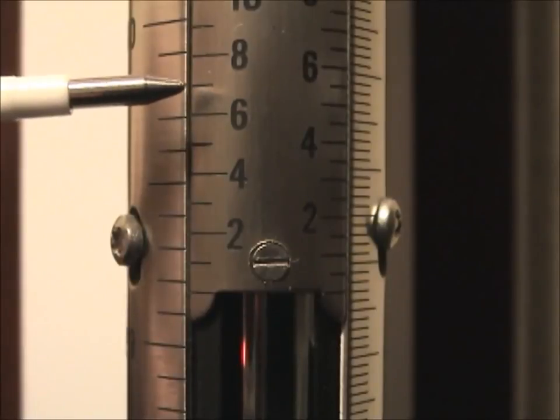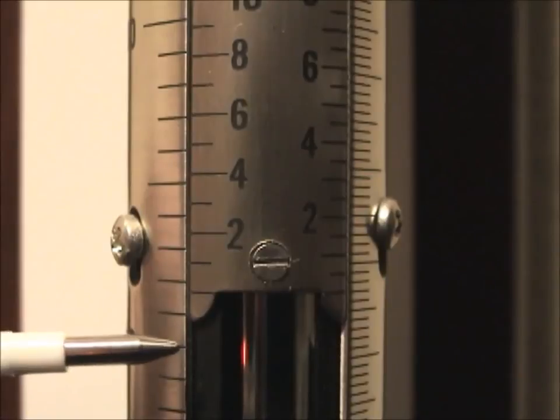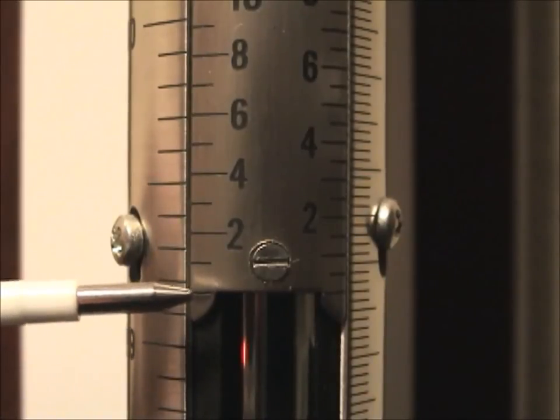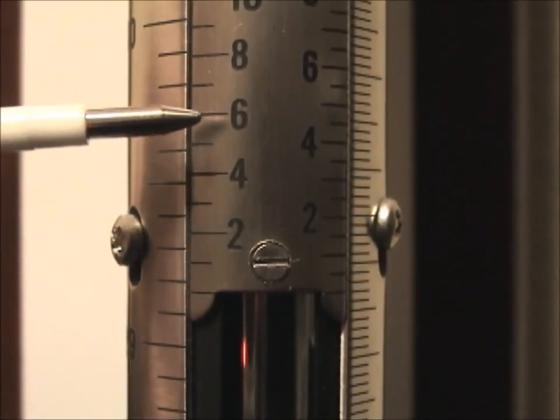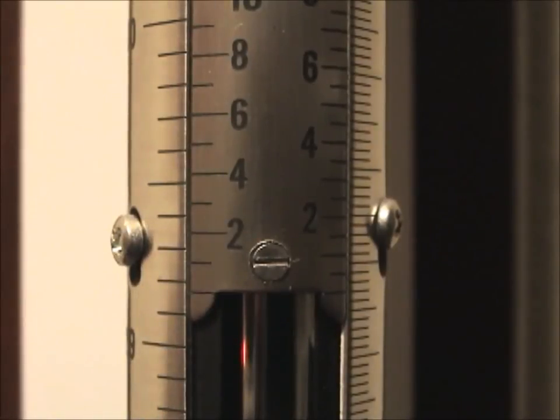However, after reading these barometers for over 20 years, I can tell you that this number is 8. So our pressure is 29.168. And that's what we'll put in the computer. So we need to take our mercury temperature reading, and that is 71.8 degrees Fahrenheit.